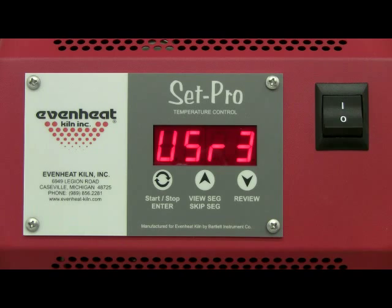Press the enter key to store your choice. The display now reads SEG, alternating with the number of segments that will be used for the program. A segment is simply a combination of rate of temperature, set point temperature, and any hold time at set point temperature. For our example, we will use one segment — we're simply going up to a temperature, holding at temperature for a period of time, then shutting off. It's pretty straightforward.